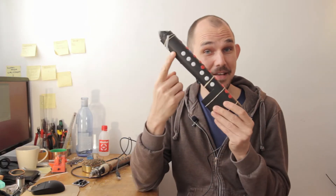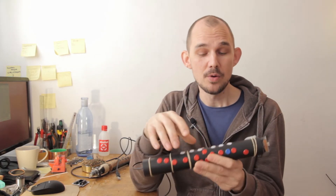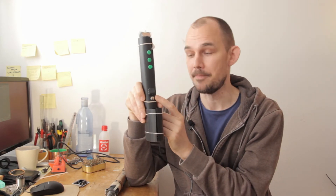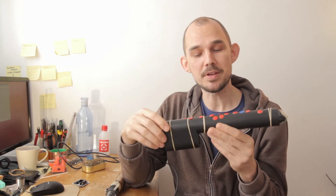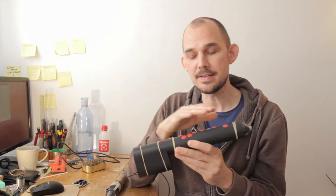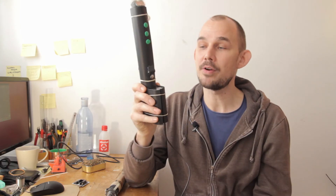The six remaining keys — these white ones here — are different, in that they are read and interpreted independently from the breath sensor and from each other. Each key simply outputs a MIDI note-on message, which I'm then using to control a looper like you saw in the beginning, but it could really be used for percussion or any other MIDI purpose. The last thing on here, which maybe looks a little bit like a key but it's actually really not, is this thumbtack right here underneath the thumb position. Unlike all of the other keys, this is uncovered metal and provides a direct connection to the microcontroller's ground. When you're working with capacitive sensors, grounding yourself to the microcontroller can really help to stabilize the sensors a lot. In this case I only needed that because my sensors are pretty crummy and have a very low resolution — so this ground connection fixed that.